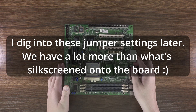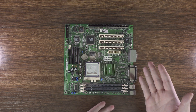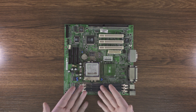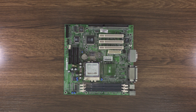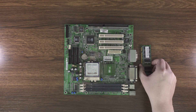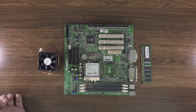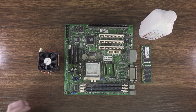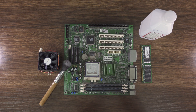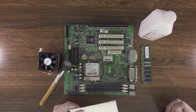So that's quite the interesting board. Since we've got onboard video, onboard audio, and a CPU in here, once we clean this thing up, all we need to do is add a little bit of RAM and a heatsink, and this thing should just boot up. So why don't we do that right now? I've got some isopropyl alcohol, a dusting brush, some paper towel, and some q-tips. Let's give this a clean and see what happens.